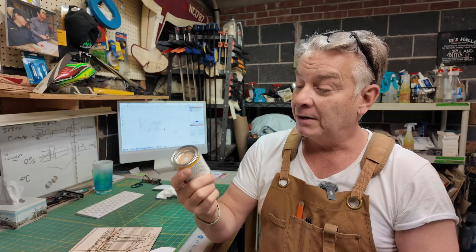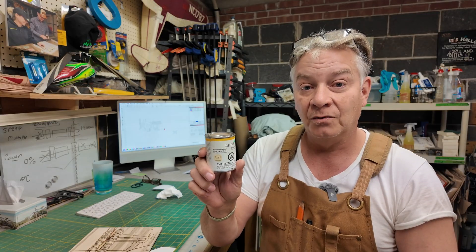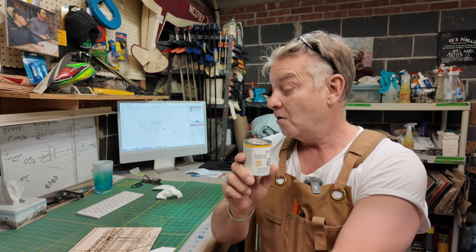I'm going to throw a bit of finish on there. I'm using this stuff called Osmo — I also get this from KJP up in Ottawa. I've only used it a couple of times; I'm kind of new to it, but it's a wax finish. It goes on as a liquid, and the beautiful thing about it is it goes on clearer — it does not discolor your wood, especially with exotic woods or ambrosia maple. It's not going to yellow it or discolor it; it goes on just as clear as the wood looks right now. Thanks so much for sticking around. Have fun with your lasers — try different materials, and especially if you're into woodworking, try different species of wood in your Nova Plus. I think you'll get some really nice engraves out of that machine. Have a wonderful week. I'm Gord Potter and you've been watching LaserNug. Cheers.